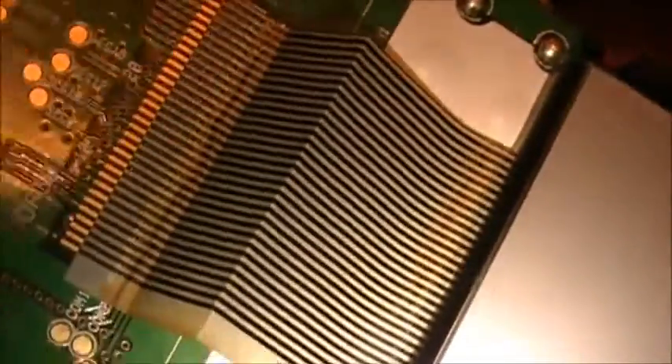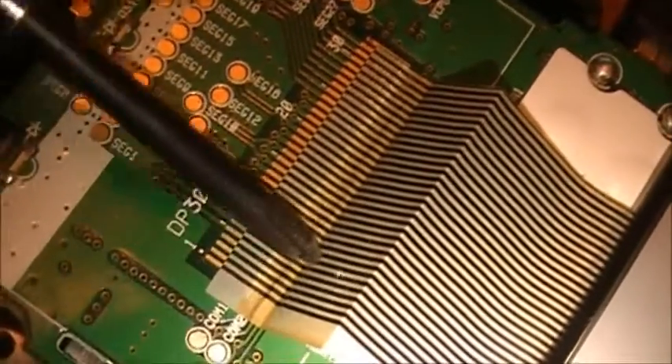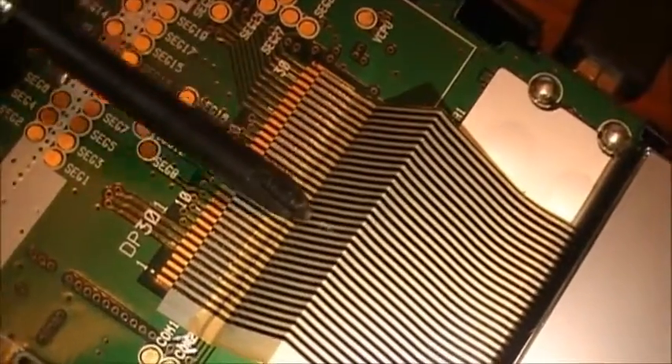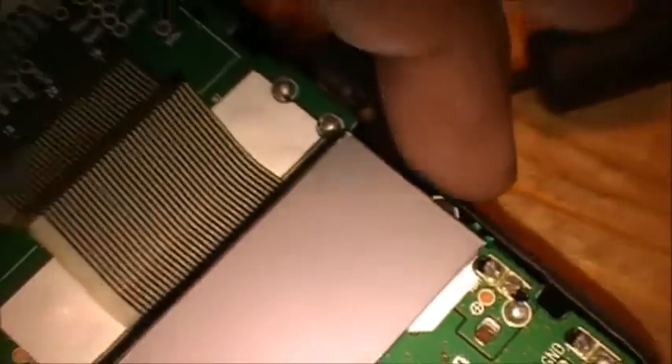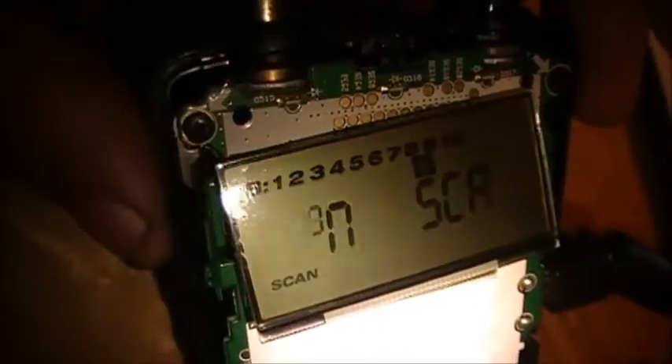You very carefully take your soldering iron and go across this little edge here — go along here very quickly. Again, not too much heat. The heat will actually adhere this strip to the copper better. I did that and it actually helped — it fixed the problem with my LCD. Instead of having half the display not working, now the whole display works.